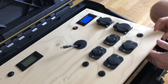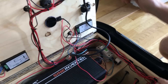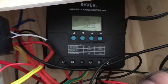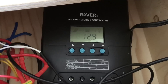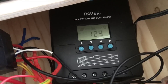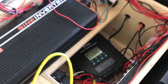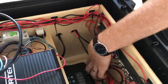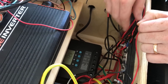There's a single switch on the front. When I throw this switch it lights up and both relays are activated. You can see the unit powering up. Right now the batteries are at 12.9 volts, and pretty soon it'll be calibrating itself — and now it starts feeding power from the solar panels. The charge controller also has an output for 12 volts directly, but I don't use that; everything I use goes through the batteries.